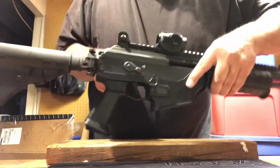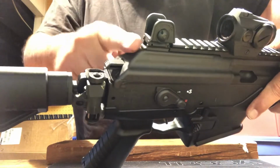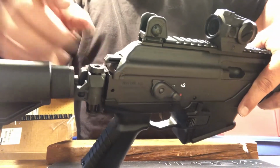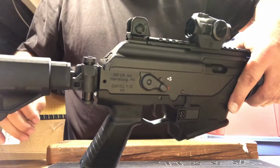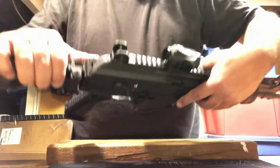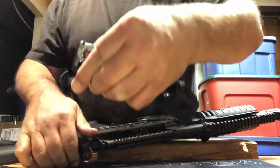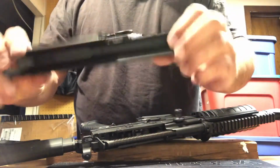we'll start over. I've cycled the bolt back, and as you can see, one of the things that keeps this dust cover so tightly in place is this extra long button to release the dust cover. And what I want to do is push it in far enough that it engages internally, okay? And if you look real close, you'll see that it's not sticking out at all. The metal is here. So here's the tricky part. I don't want to pop that out. I want to get that out. So I used my thumb and I pushed like crazy on that sucker. Okay, so there's your dust cover.